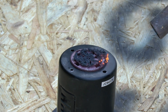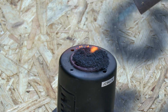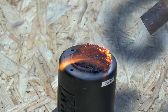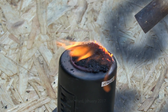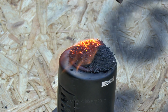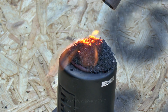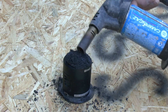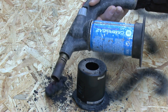This is supposed to be occurring when there's actually a fire in the room downstairs, and the point of this is to stop the flames from passing through the hole, at least for a certain amount of time - around 30 minutes or however long the thing is rated for. As we're heating this you can see various particles flying off - that's probably not typical in an actual fire since it wouldn't have a directed jet of flame like this. But as you can see, it's expanding up and sealing the hole just as expected. After approximately a minute it's formed a big black charred mass which has fairly effectively sealed the hole in the top of the can. It's fairly loose and crumbly, but it's done the job it was intended to do.